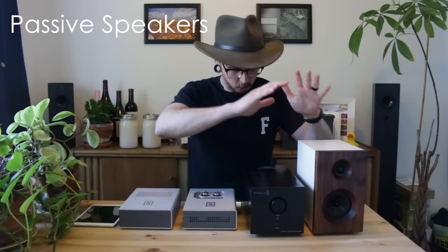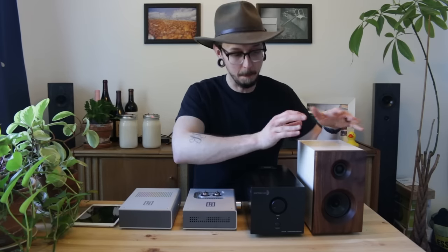So we've finally got to the noisemakers. That hot signal coming from the power amplifier comes into the back of the speaker and meets the crossover. The crossover filters that signal and connects to either the tweeter or the woofer, or both at the same time. In this speaker, the mid to low frequencies travel to the woofer while the higher frequencies are filtered out, and the high frequencies connect to the tweeter while the mid to low frequencies are filtered out. The electricity in the signal affects the magnet, the magnet moves the cone of the driver, the driver moves the air in the room, the air moves the diaphragm in your ear, and your brain interprets that as sound.